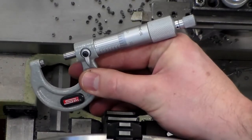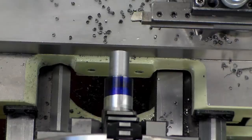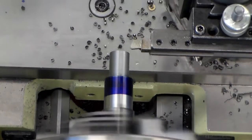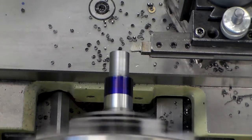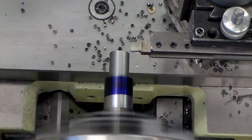We're at .697. After my first cut I was at .896, then I took two more hundred-thousandths passes and removed basically a perfect two hundred thousandths.